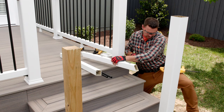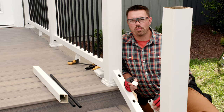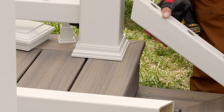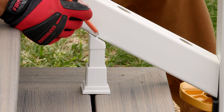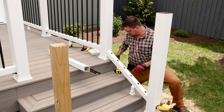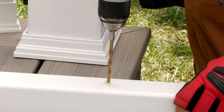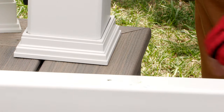Set the bottom rail to the lines marked previously on the bottom post and temporarily support the bottom rail with a clamp. Before we mark and drill for the foot block, add the stair adapter to the top of the foot block. Since the foot block extends to a maximum height of four inches, set the bottom rail in place and find and mark the location for the foot block near the center of the bottom rail, but no greater than four inches from the tread to the bottom of the bottom rail. Drill a 3/16 inch hole at the foot block location, centered at the width of the bottom rail. Start the hole at a 90-degree angle, then pivot the drill to roughly match the angle of the stairs.